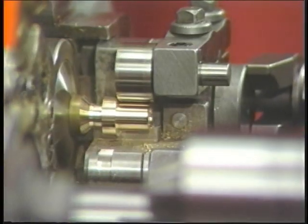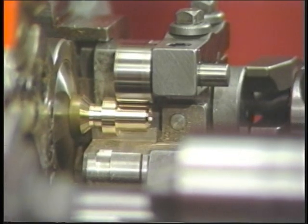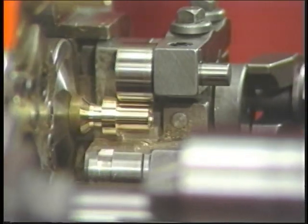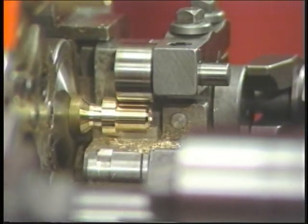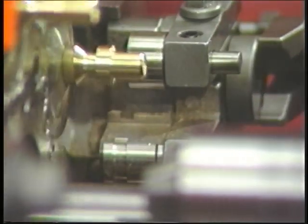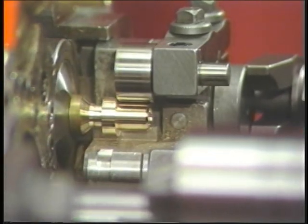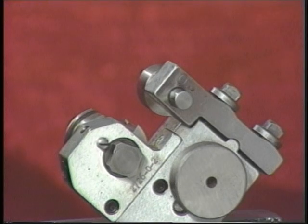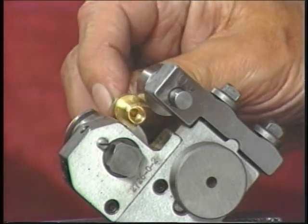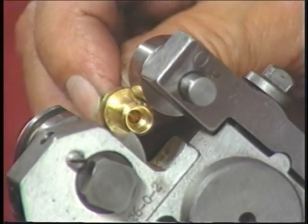This is done because the tool of the E2726 holder goes to the center of the workpiece tangentially rather than going into the workpiece on the center line. The spring loaded holder allows the tool to maintain an equal diameter between the tool and the roll at all times by exerting roll pressure on the workpiece while the workpiece is being machined. For the initial setting, use a part or material that is the correct size and adjust the roll so that the material just passes between the roll and the cutting edge of the tool.